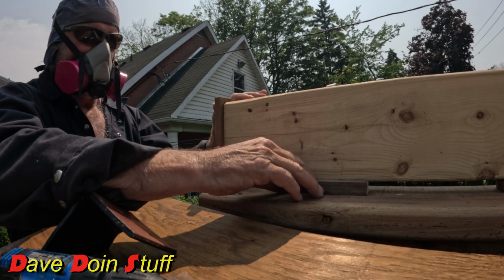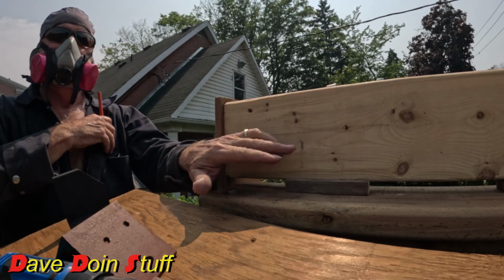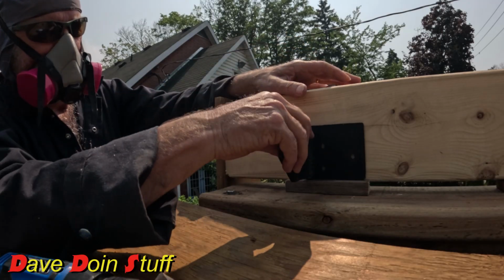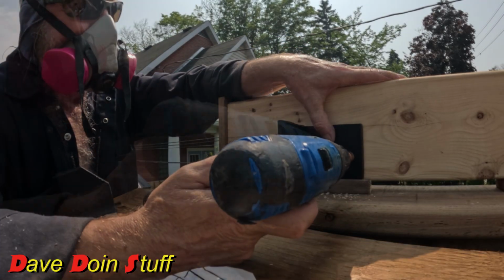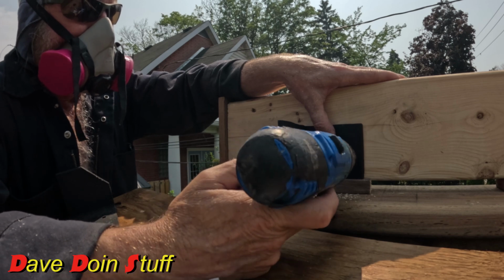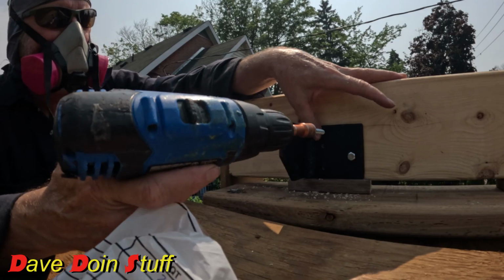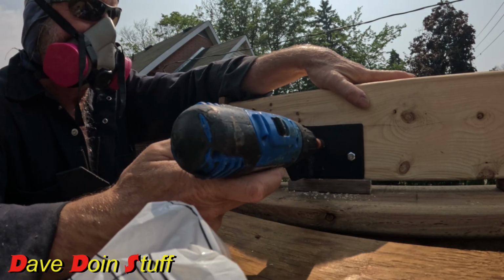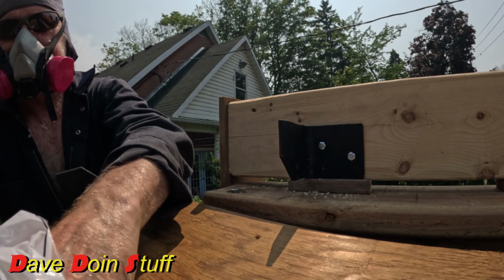I just put a spacer on the top of the shed. I marked the top with a spacer so that I know which way's up in case it's not a square piece of wood. And then the first angle iron, I just put it on the roof section resting on the spacer. That way I know it's parallel to the top of the shed. And then it's just a matter of putting in the 3 anchors. And I used 3/16 inch and a quarter lag bolts. You could use anything. I just wanted something heavy enough that was going to hold the weight of the door over time.